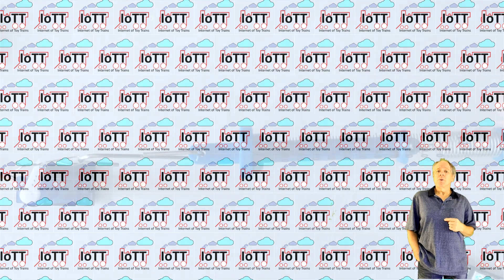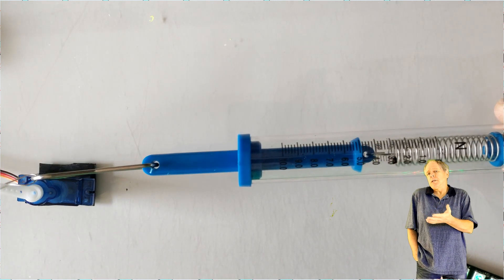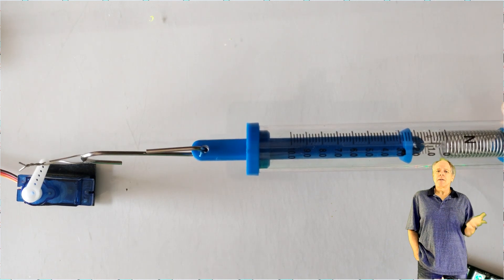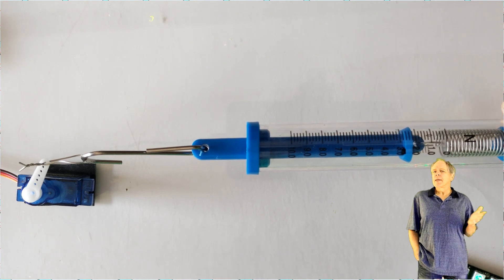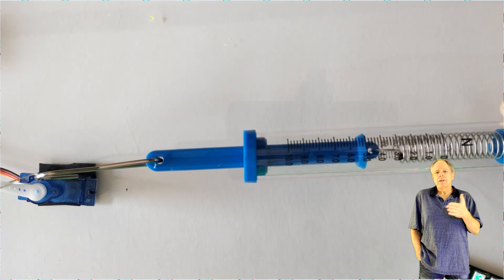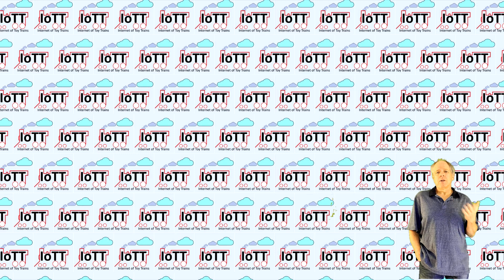The reason is that the green hat is configured to remove servo power after the servo reaches its position, to avoid humming noise. Since there is no power, the servo will move if a certain torque is applied. Not so the linear drive — the screw drive is not back-drivable and the screw will break before the motor is moved. I like this feature because it guarantees that the servo position remains the same if the servo is not powered. For the SG90, the maximum force without back-driving was around 2 newtons, but once started, the servo moved 90 degrees without hesitation, increasing the force to about 7 newtons. The linear servo, on the other hand, developed just a little less than 2 newtons — clearly below my expectations.